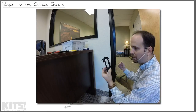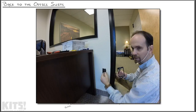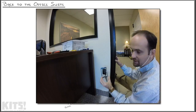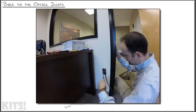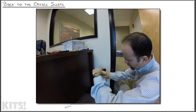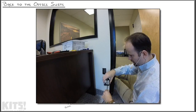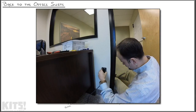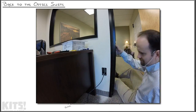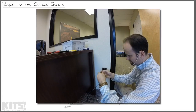We can look at this and see about how far the inside frame is. If you use the same model of these all the time, you'll probably create a template that you can use. You just line up on the wall and cut it exactly. But for now, I'll just look at it's about 1/2 inch in. Drywall knife. Got to be careful not to hit your cable back there. That's about right. Let's get it on there. Squeeze it in. Perfect. Screwdriver. Tighten that guy down.